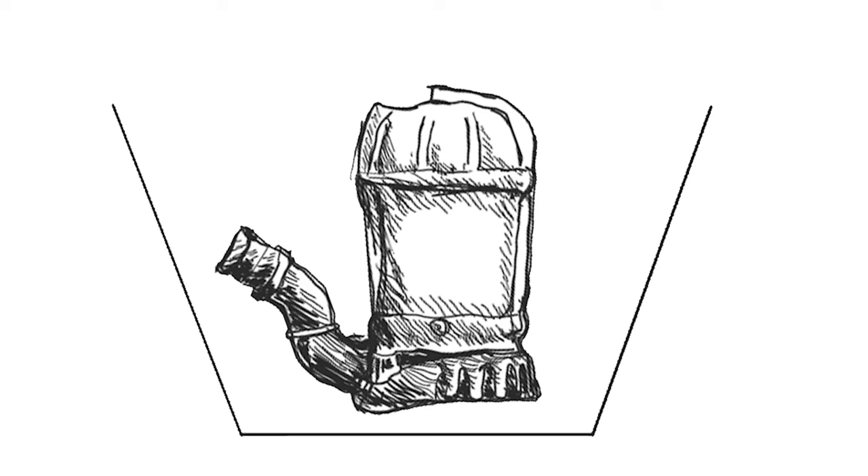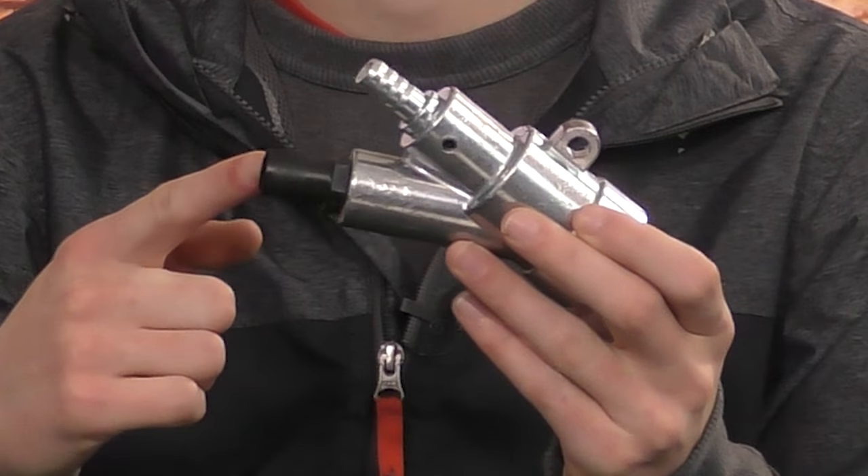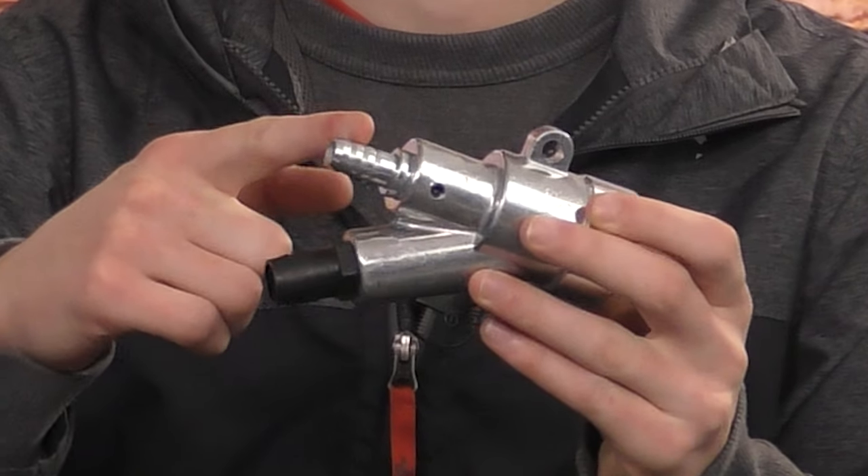Its sole purpose is to accelerate the slurry that's coming into this blast gun. In a vapor honing cabinet, the pump system that supplies the slurry to the gun is completely separate from the PSI or the pressure that you're supplying to this. Your air pressure is going to come from your air compressor and the slurry system is going to be inside of the hopper — that's an electric pump. On the blast gun, this lower inlet is where the slurry is introduced and this upper inlet is where your air is introduced.